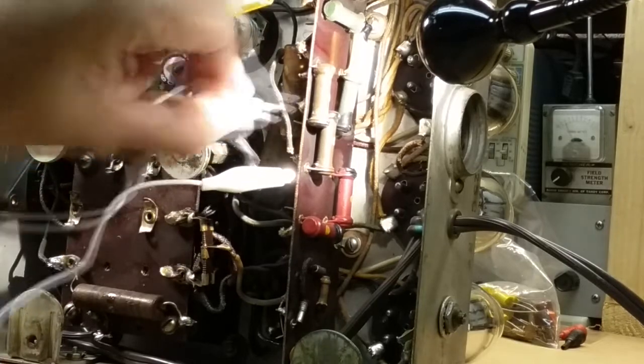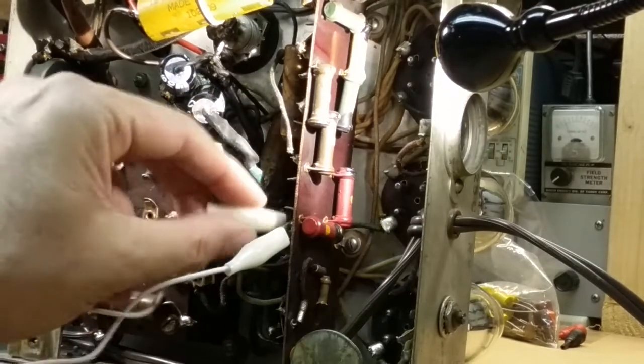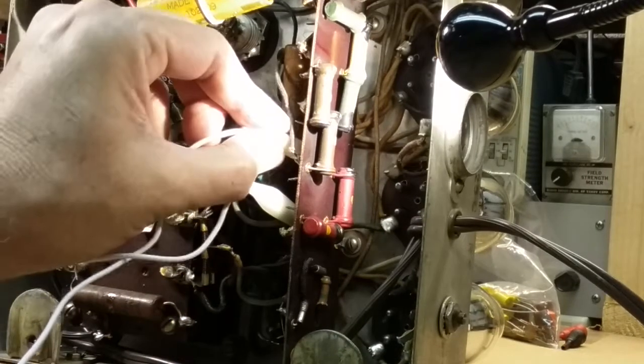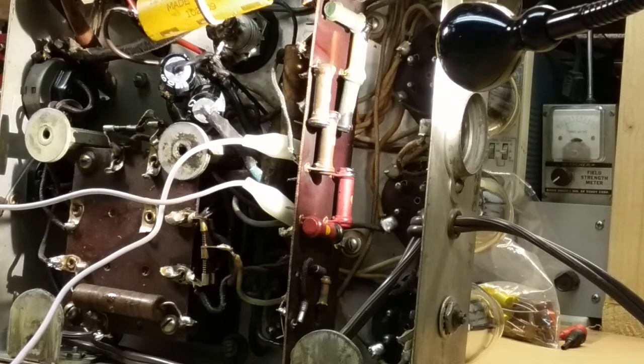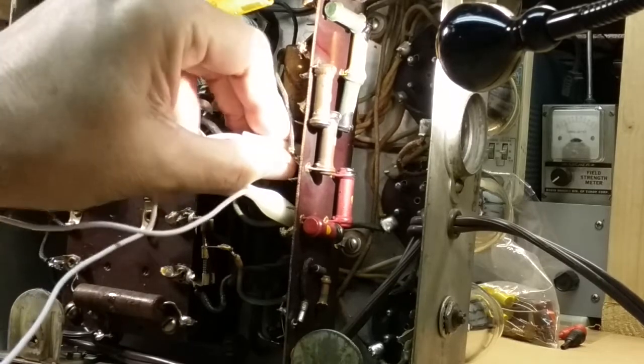Now we'll try those 200Ks down here in these red ones. Let me try this one first. This is my halfway point. I got 275K, that's bad. Which I figured these would be out. These are the power circuit. It has a lot of draw on it, and with the bad capacitors on the B plus line, it would have pulled those out. That one in the back is 250K, it's out of spec too, it can't be more than 240. So those have got to be changed.